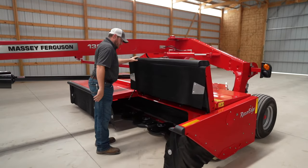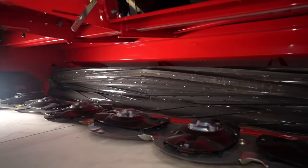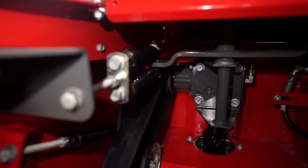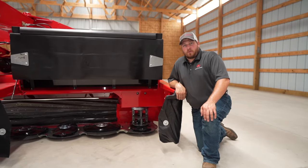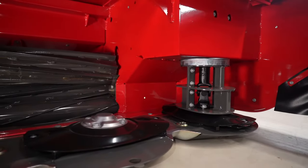The Razer Edge is a spur gear driven one-piece welded cutter bed. Unlike other designs that use a shaft in the back of the cutter bar to drive the individual modules, this uses gears in between the modules to transmit the power. The discs spin at 2450 max RPM, which equates to 189 miles per hour at the tip of the knife.